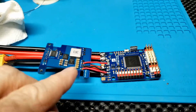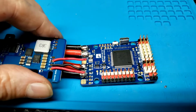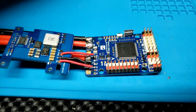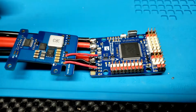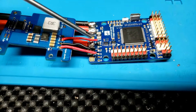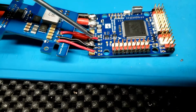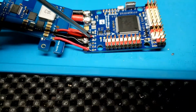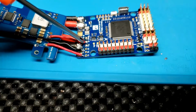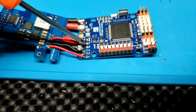And there's the BEC board and the three wires. They're just pre-positioned. None of them are soldered yet. I shouldn't have to have any solder. I should just be able to put them where they need to be with the little slot in this solder helper, and then touch the soldering iron to it. Of course, I'm going to have to put this phone down to do all that. That's the wrong wire. That's not a ground, but right there is about what I'm going to try to do. And just run in there and tap the solder and get the iron right back out.